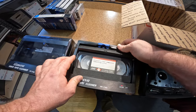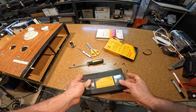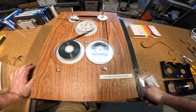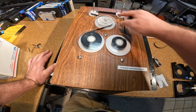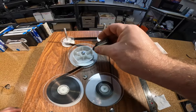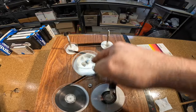Next we'll rewind it in here — one last cleaning. Ripping again is very unlikely because of what we just did to fix it. We got this one unscrewed; let's go ahead and see if we can get this done before this customer shows up. This thing is so useful. This little hole in the spool makes it really easy to apply some alcohol on the front of the tape, and then it dries it off as it goes.